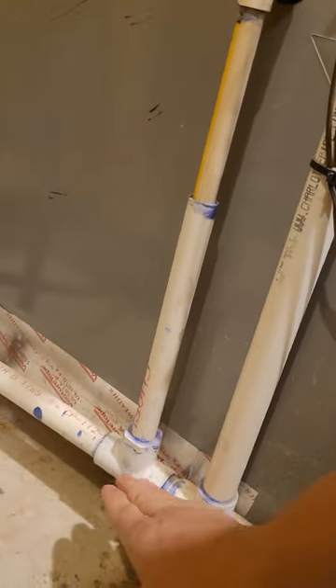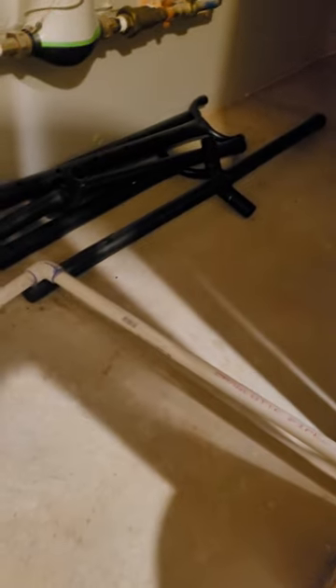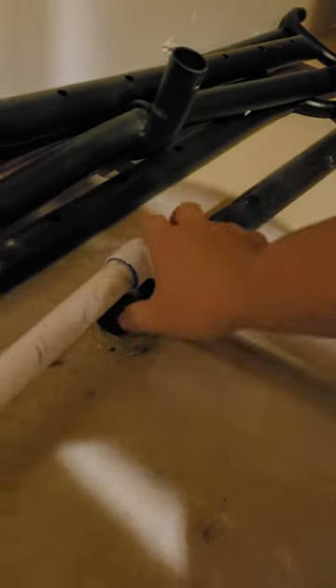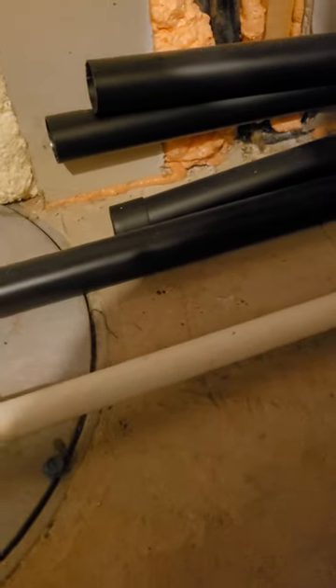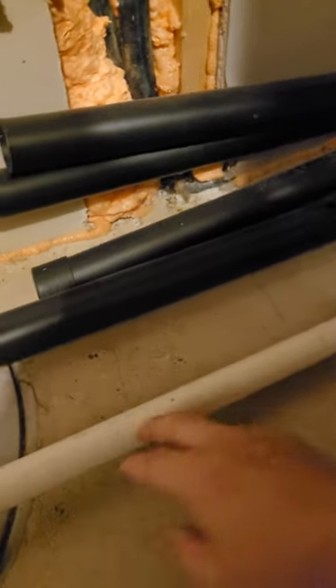It's supposed to — you see this downward angle — the gravity is supposed to carry the water. I think my big problem was this sump pump here — that's where everything is supposed to drain out. This drain pipe was lower. If you have it going down and then having to come back up again, this won't do. If you leave it like this, if this is low, it's going to accumulate water here and not properly drain the water.